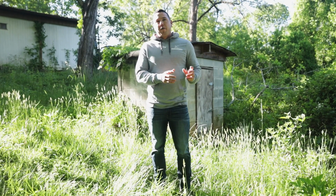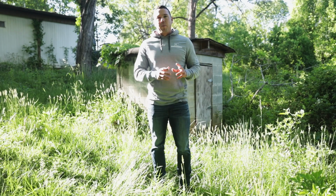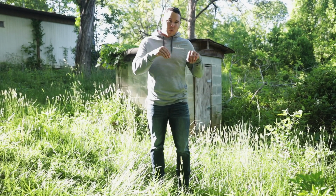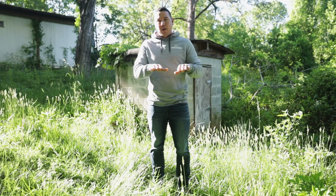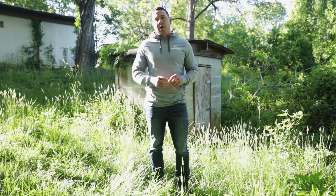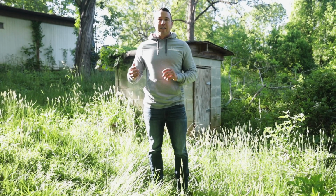The C&D stuff, we can have nothing over 4 foot long. So we use the machine to break all that stuff up really small for 2 reasons. Number one, the landfill doesn't want anything over 4 foot long, because when they put it down in their trailers, it can then push holes in the sidewalls of their trailers. And number two, if everything's broken up really small, we can put more into our dump trucks to get it all out of here faster and in less trips.